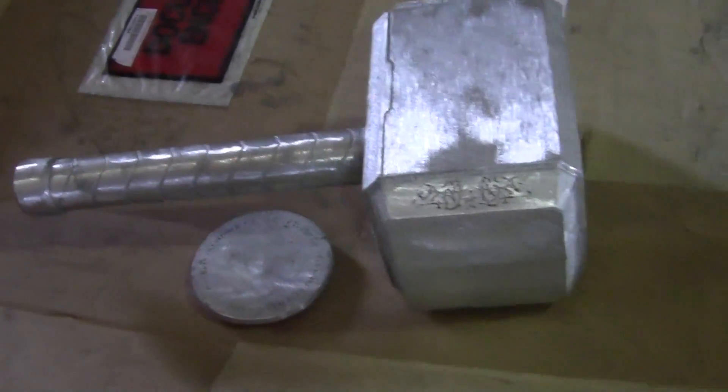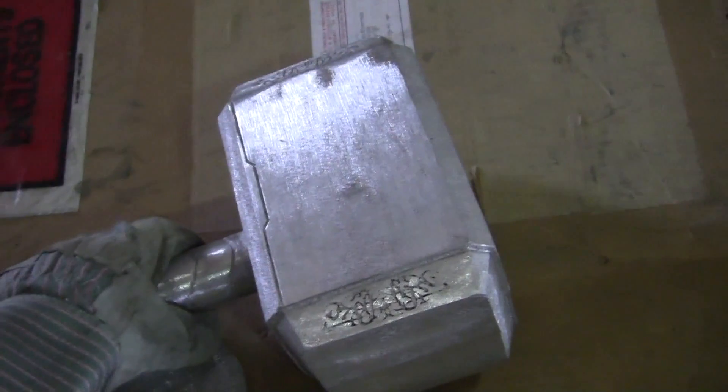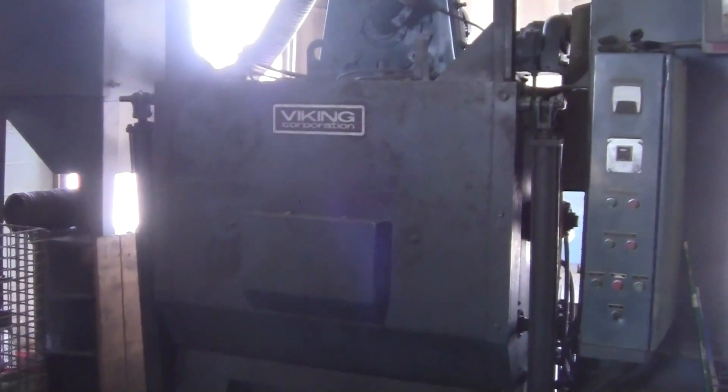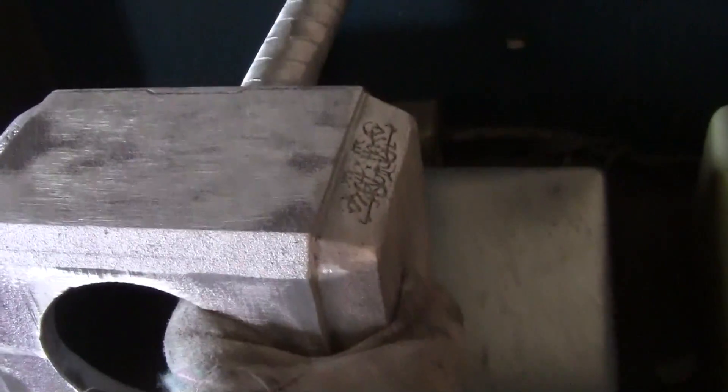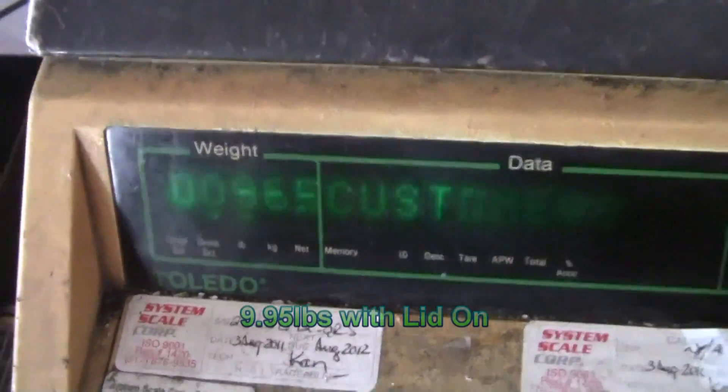The hammer's done. There's one last thing I'm going to do to it — I'm going to throw it in the shot blast. The shot blast is that machine over there, and what it does is shoot it with shot. Now it may look like sand, but it's actually extremely small beads of steel that hit it at really high speed and give it a good finish. This hammer's pretty heavy — I'll take it over to the scale and weigh it. The wall thickness between the inside wall and outside wall right here is about an inch, inch and a quarter. Looks like it is 9.65 pounds.